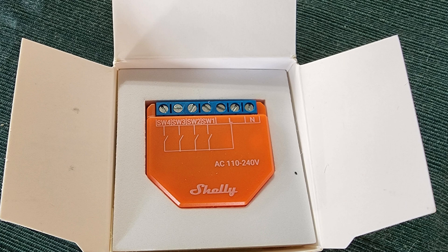This is a 16-channel rolling code RF remote. I can use it to send over 270 commands to my home automation system or any number of other things I'll cover in another video. When combined with this Shelly input device, I can create a robust and secure remote using messaging. For my purposes and existing setup, I'll use my MQTT broker and program the logic for this remote in my main command handling script.